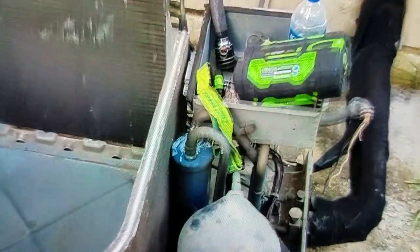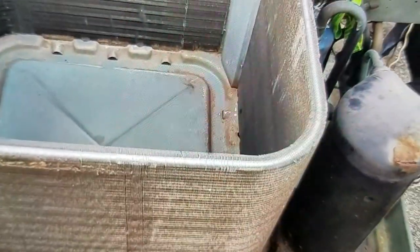I want to get this thing back together tonight. Don't want any critters fooling around in here, hurt themselves or damage my coil. And I know how to use one of these fin combs. You can see it's curved in one direction. And it's got that slider to adjust how far apart, and I guess also how stiff it would be.